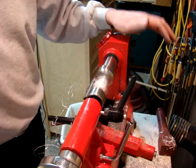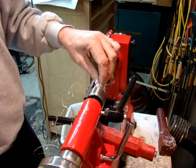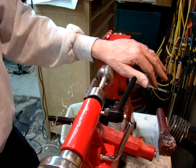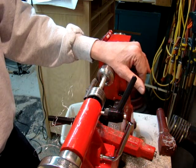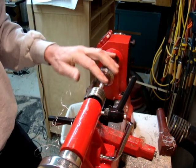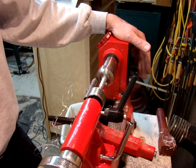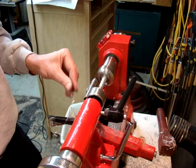When working with aluminum you might want to wear some leather gloves — although I'm not sure wearing gloves and working on a lathe is a good idea, so strike that. Keep lathe safety in mind: make sure you wear goggles and a face shield or something like that to protect your eyes. And don't try to clear the aluminum out with the lathe running, because it can certainly cut you pretty easily.